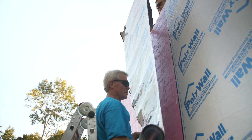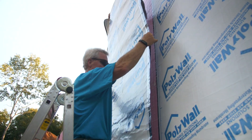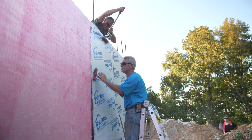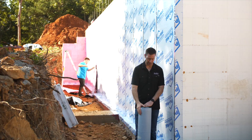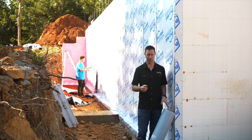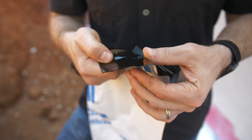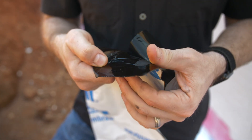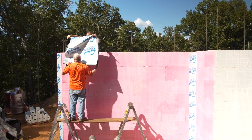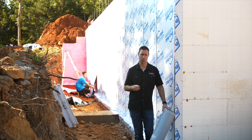That's why I like this system by the Polywall guys. We're going to be using their Home Stretch family of waterproofing here, and everything they make is fully compatible with this EPS foam on this ICF house. The heart of the system is this right here — it's a peel-and-stick product, 40 mils thick, which means it's very thick and gummy. It comes in a roll that's three feet wide by 67 feet long, so basically 200 square feet, and that's what you're seeing behind me on this wall.